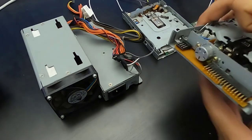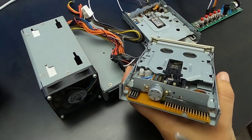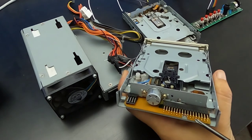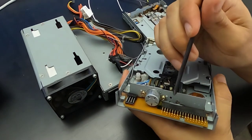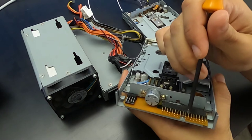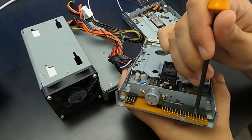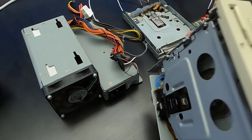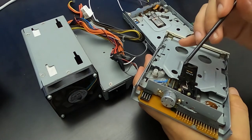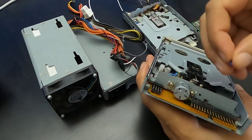And now let's see how to use the other pins. The first thing you need to know is that all the pins in the second row, the bottom one, are connected to the ground. For the first row instead, all the even numbered pins, we will only need 3 pins, just to control the movement of the head. The pins in question are 12, drive select, 18, direction, and 20, step. Pin 12 is used to enable our floppy and turn the LED on. For now we connect it to the ground with a jumper. In the next video we will see how to use it to go to the read.